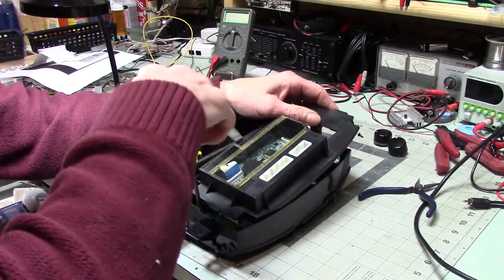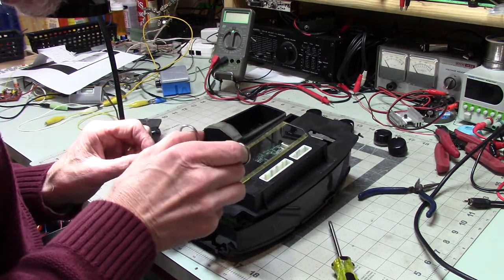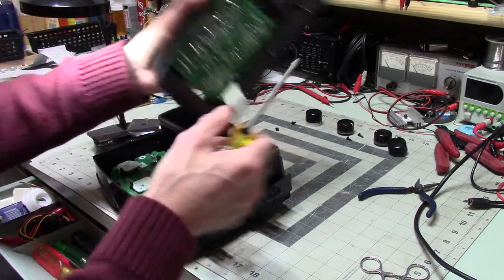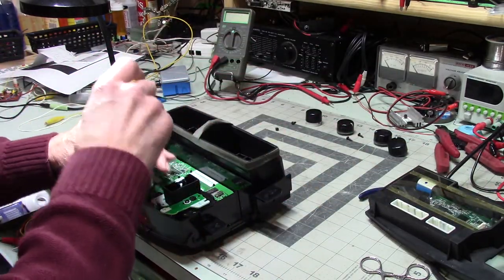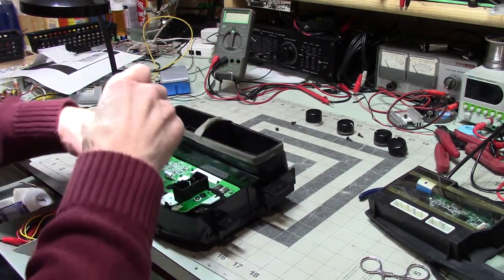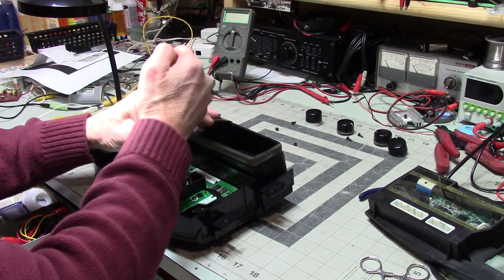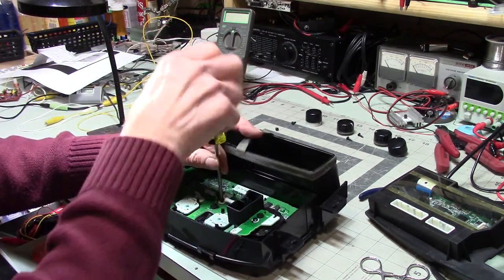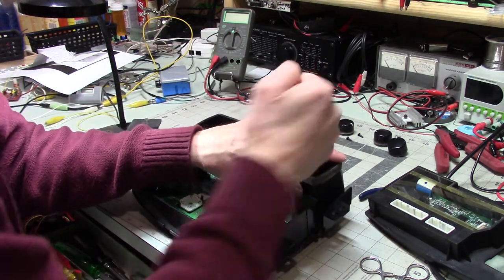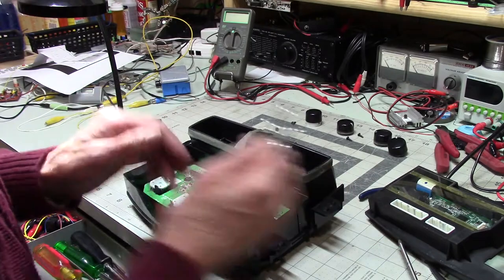one of the ways you try to make something last longer, when, for instance, you're controlling something that draws a lot of current, ew, and, all right, fine. That means I'm going to have fun putting it back together, which probably means I'm going to have to pull that plastic cover sheet off so I can reach in there. Come on. So anyway, you've got something that draws a lot of current. You can put a really beefy switch in there. Or you can put a relay in and then control the relay with a lower current switch.